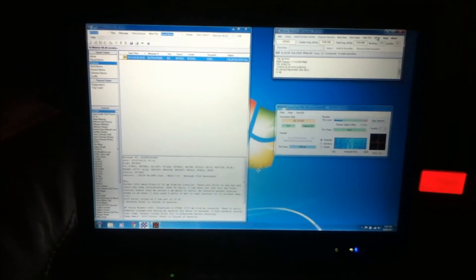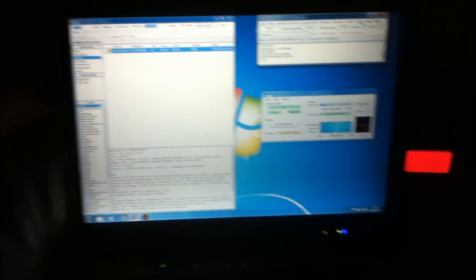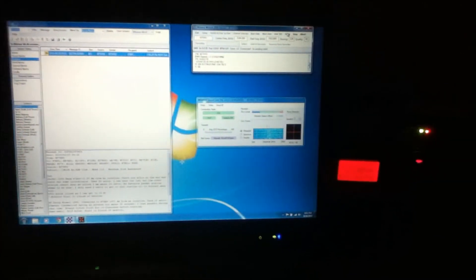This station is K7DAV, which is about a thousand kilometers away from me. We're going to transmit this email and then shut down. I think I'm going to bump up my power slightly because I'm getting repeats. I'll go in here and turn that up — here's the wattage — putting it up to about 10 watts and lowering my ALC down slightly.